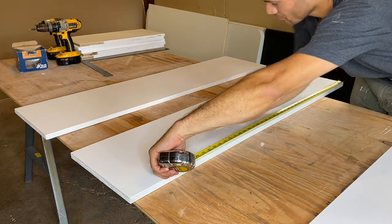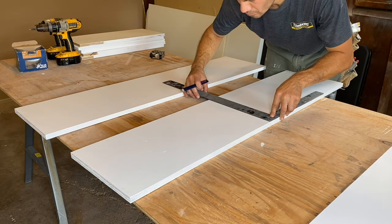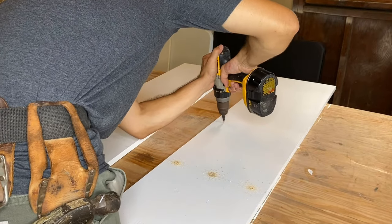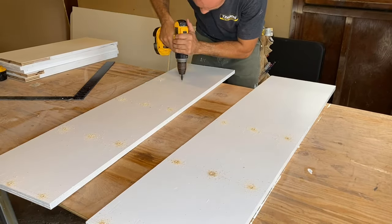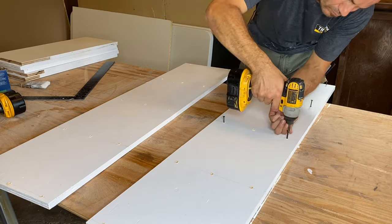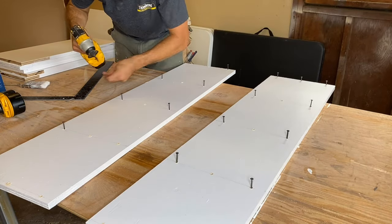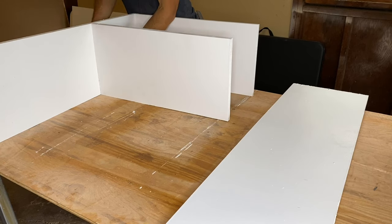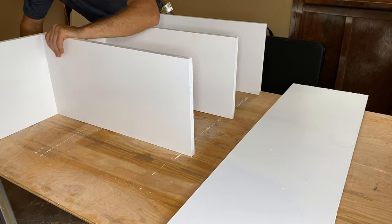Now I'm going to build the shelving unit. So I'm marking off about every one foot, and then using my square, just drawing straight lines so I know where to pre-drill my holes. I could have run dados for my shelving, but it's just an office closet, so I don't want to get too crazy with it. So I'm just going to pre-drill three holes in each line, and I'll be able to screw my actual shelves into this box and make the whole shelving unit. I'm just putting the screws in just a little bit at first, then assemble your boxes. Make sure your shelves are straight up and down — you can use a straight edge or a square. Make sure your spacing is perfect and screw everything in nicely.